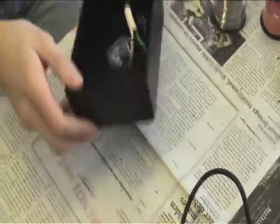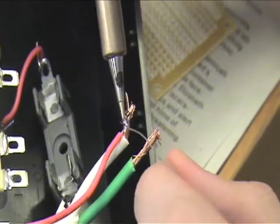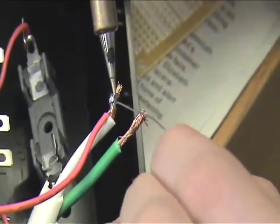So next we're doing soldering — and remember, soldering is very hot, so make sure you're careful and be smart. Once you've stripped away some of the insulation from your inner wires, you're ready to start soldering. Solder your fuse holder and switch in line with your hot wire. Now take this and your neutral wire, and solder those to the two contacts on the primary side of your transformer. Then solder the protective earth ground wire to the center contact of your secondary circuit on your transformer.